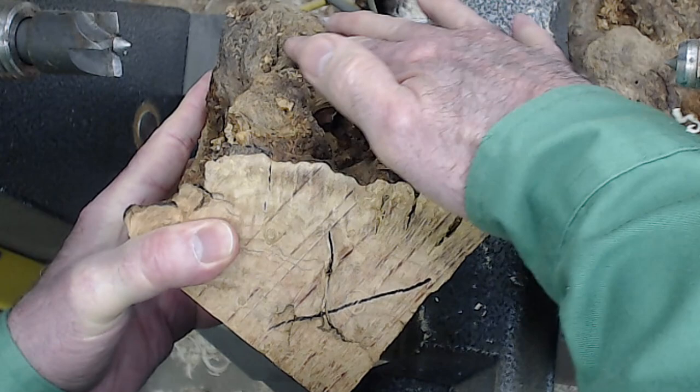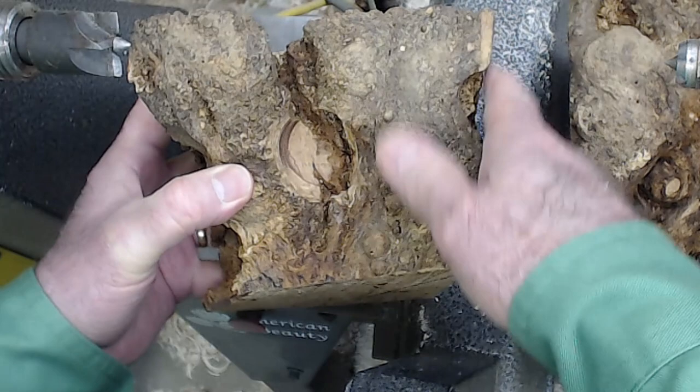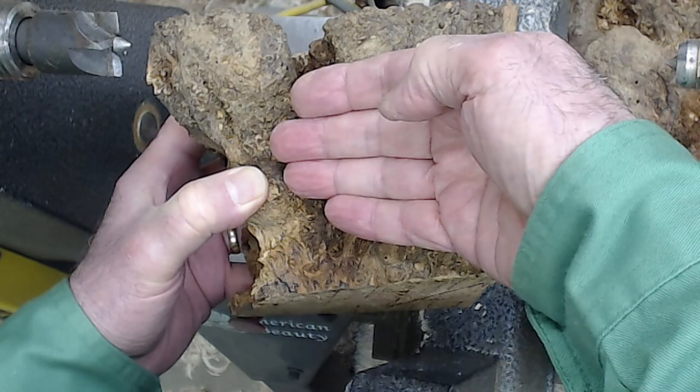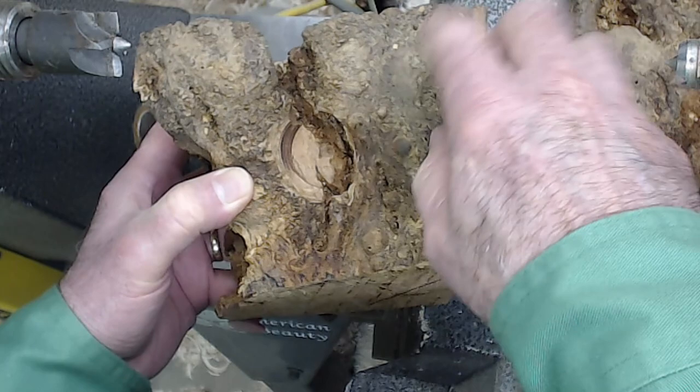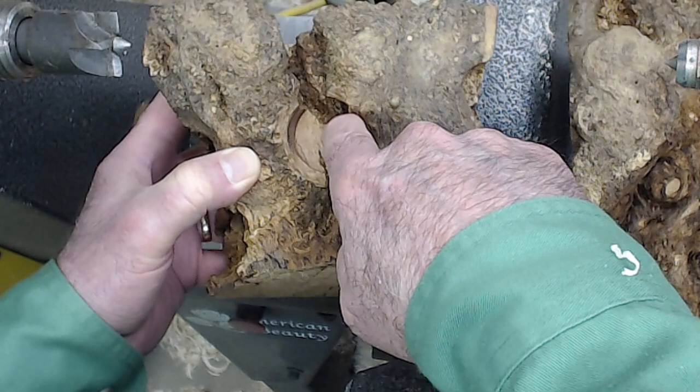Now this has a relatively flat area here that lends itself to a neck. So I'm going to put a neck on this. There's no deep void that's big enough to start with the hollow form opening coming undercutting a shoulder. So we're going to use this top surface to make a neck around my vessel to keep a natural edge flow and have no remnants of the opening.